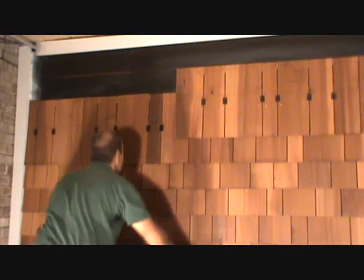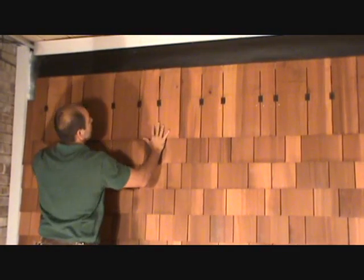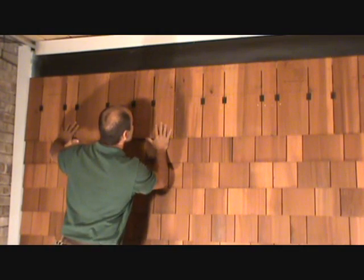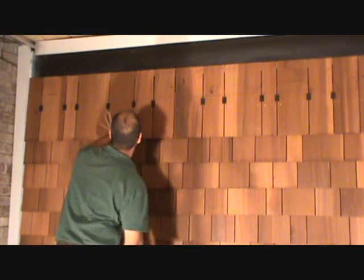You don't need to worry about matching the numbers again unless you're crossing over a window or door space. When the numbers are aligned at one point, they will continue to match throughout the course.